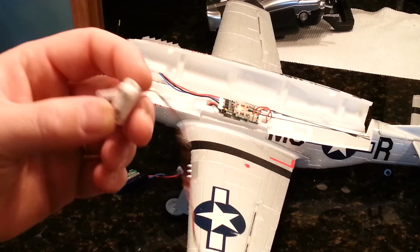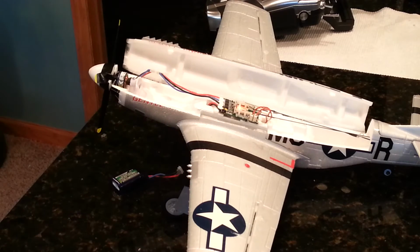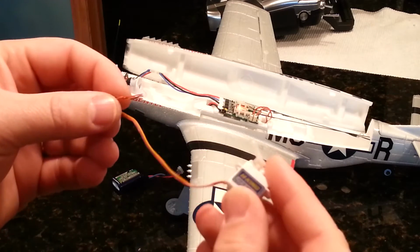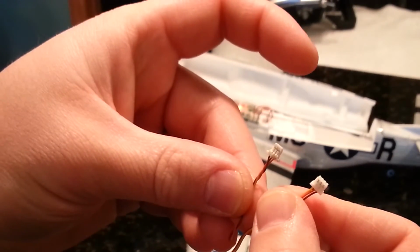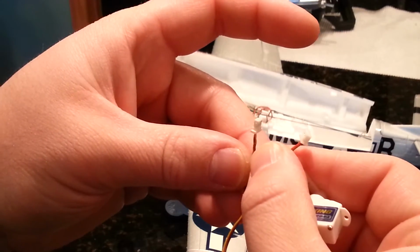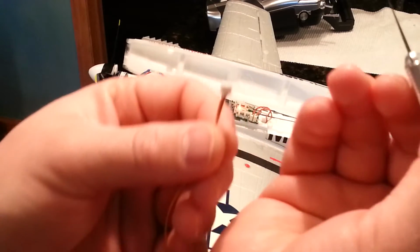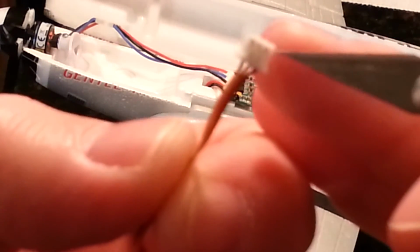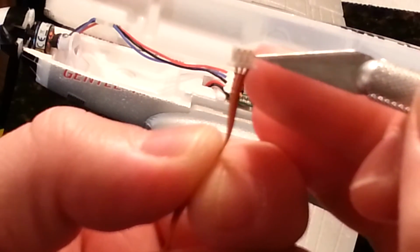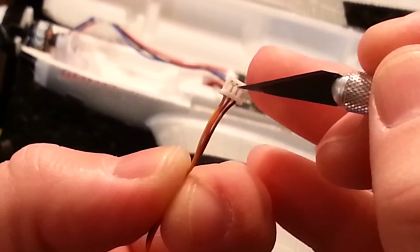So basically, this is a servo that's going to be used. It's color for color. If you do cut off the factory end on your standard Turnigy, Hobby King, whatever this is, the colors do not line up, they're actually inverse of each other on the layout, but they're also a different connector, of course. If they were inverse, you could just pull the pins and switch them. And the way you do that is you just take this thing, and I'll try to zoom in. It's going to be a really hard thing to film, guys. But the way you would do that is you would take your X-Acto knife or whatever utility you're using, and you get up under there and you pull it up, then you yank that one cord out. So you can pull each of these little plastic pins up, and that wire will be allowed to come out.